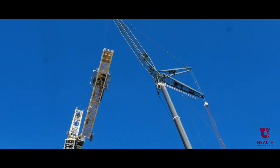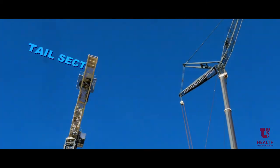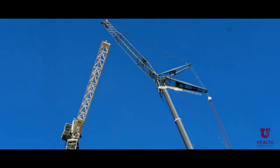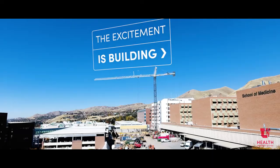After we get that house section in, we bring the tail section in and set it in. Then we bring the inner jib section and set it in. And then we bring the rest of the jib in, along with putting counterweights in the back end of the crane. And everything bolts up as you go along.